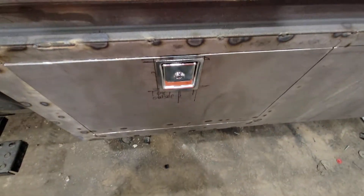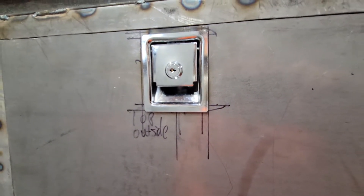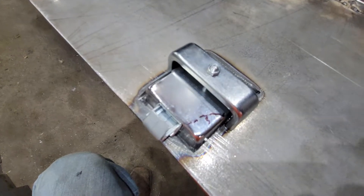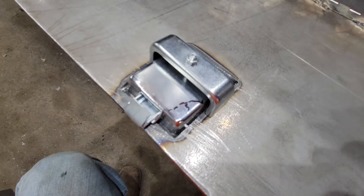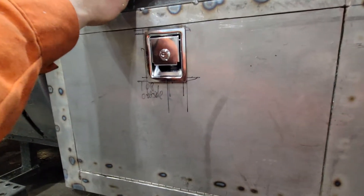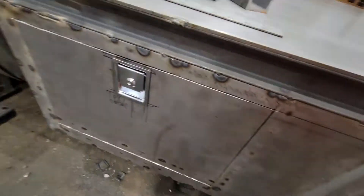The latches — that's a big thing for me, trying to figure out how to do a latch. You can buy latches, two of them, for like $20-30 bucks with locks. I used a plasma cutter to cut them in, but you could just use an angle grinder — you don't have to spend money on that. Took the inside, put a quarter by one piece in there, and whenever it goes up against there, it hits the backside perfect. The flux core welding worked out really good for this.